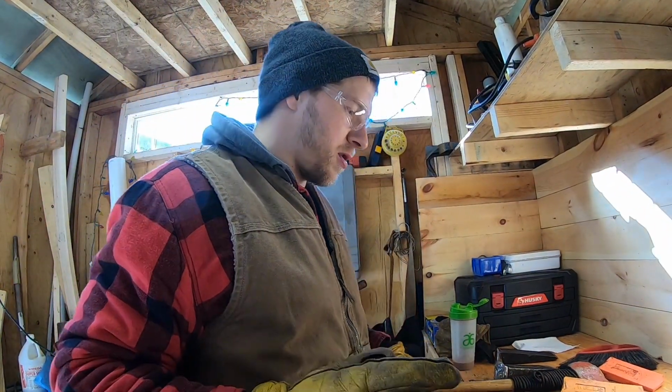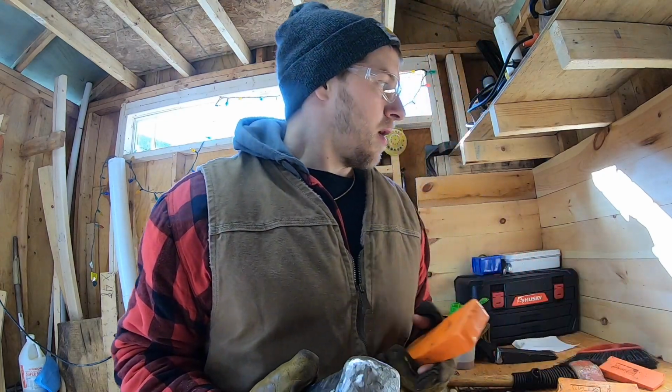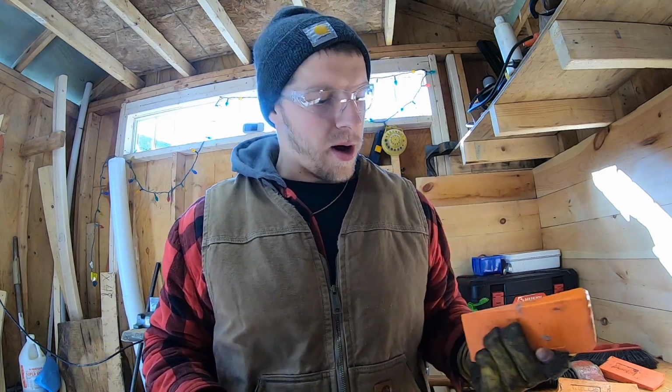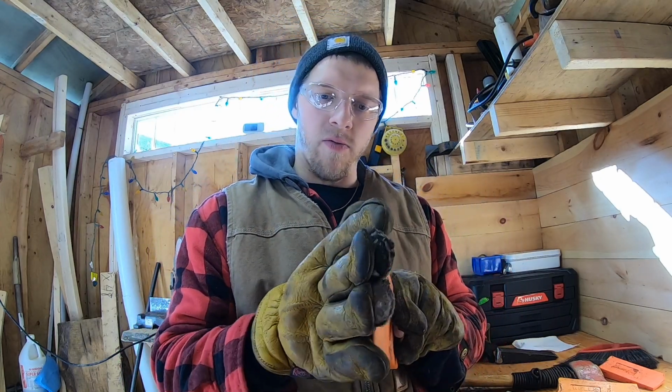All right, everybody, I'm pretty sure that's all the time we have for today, but let's just take a look. So we have nice reprofiled, cleaned up wedges. They look a lot better than, I mean, especially these will cut you when they get the lips and stuff. So now this is all smooth. We can throw it in our pack. Our felling wedges are all cleaned up. Like you saw, we did the back of the wedge, we did the front, we reprofiled that.